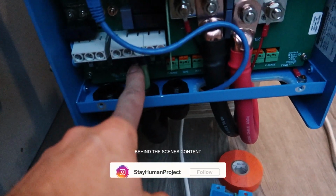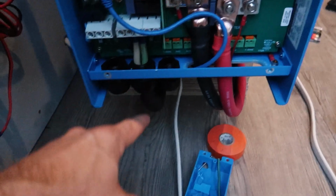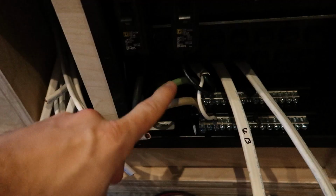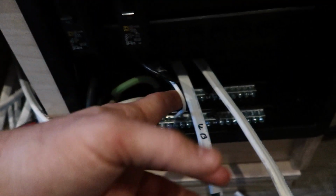You see these wires here. Those are 6 gauge triplex wires, and that runs up, and I've got it connected to the back of this piece of wood and it goes into the back, and then it comes out here to power the AC distribution panel. You have your negative, your neutral, your ground, and your positive. These are the 12 gauge triplex multi-stranded wires that run up and through the van.